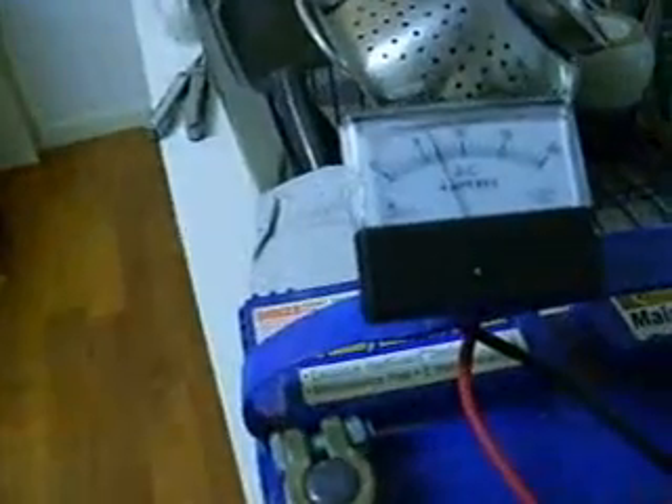What I'm going to try and do now is add some more electrolyte and try to get it back up to 10 amps to see how it performs. Now it's starting to go up — 4 amps. The voltage is just starting to drop. The cell's putting off some more now. I'm pulling just under 5 amps, about 4 amps. So obviously we need quite a lot more electrolyte with this setup. We might also have to make the space between the plates closer in order for this to work properly. Pushing just over 6 amps — that's putting off quite a bit. It's not a bad reaction.